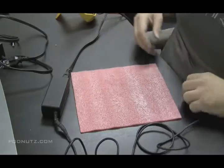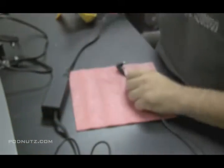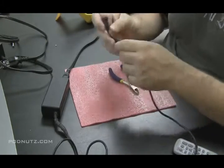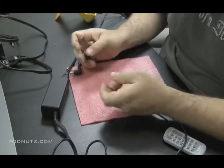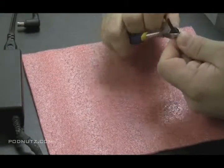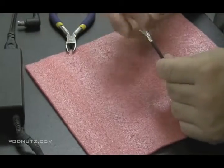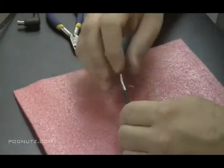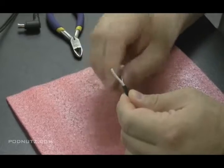Now to replace the tip on the power adapter - this is the power adapter we're going to fix. We're just going to cut that tip off - make sure it's not plugged in as you do this. We'll cut it off right at that point, make sure all the wire below that point is good with no crimps, bends, or breaks in it. I'm going to take a little pair of pliers and remove the outer casing from the wire. It might be wise to use wire strippers, but my trusty little blue snippers do okay - just don't put too much pressure when you close it.